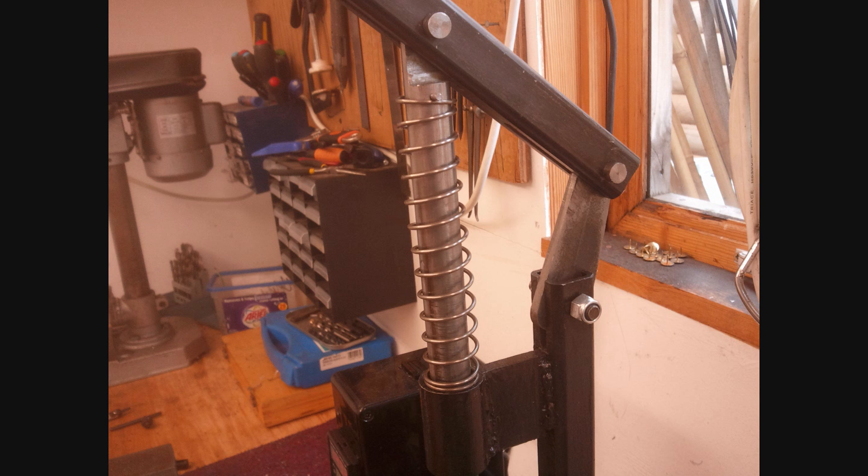This is showing the main mechanical element of the injection moulder. You can see the piston and the pull bar and a linkage mechanism there. The piston is mild steel. There's a return spring which pushes the handle back up when you stop pulling it down, which gives you clear access to the barrel. There are three steel pins, all of which are removable, with an 8mm nylon nut on the other side of those pins, and a 4mm plate at the back — so again, extremely solid. There is a minor issue with the design of this linkage: because of the way the spring preloads the pivots, when you pull down on the bar you need to push it very slightly towards the linkage system to relieve a slight binding. Once that's done, it pulls as smooth as silk. It's not a major issue, but it's something you need to be aware of.